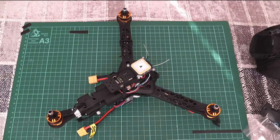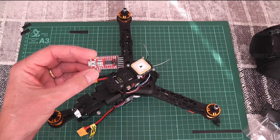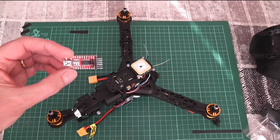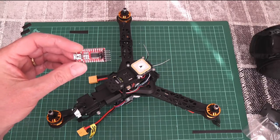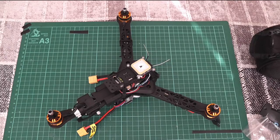I had the FTDI board from a previous project — bought it to upgrade the display on an OSD I intend to put onto this. I knew it worked with the OSD. Looking on DIY Drones I needed to update some parameters to invert the receiver and transmit signals. To do that I had to download a program called FT-prog. FT-prog didn't use the same USB drivers I had been using with that FTDI board, so I needed to update the USB drivers so that FT-prog could recognise the board, which it did. I then tried inverting the signals.